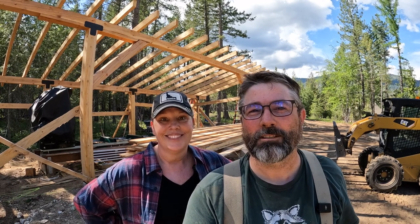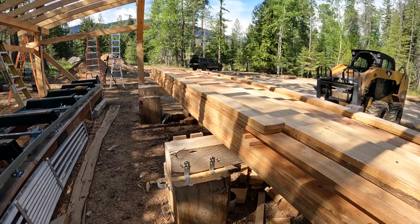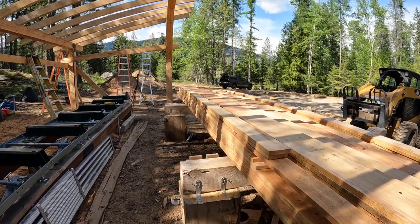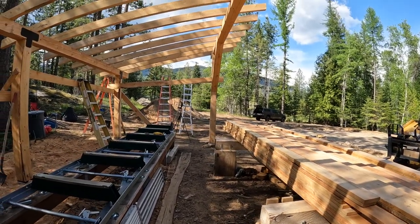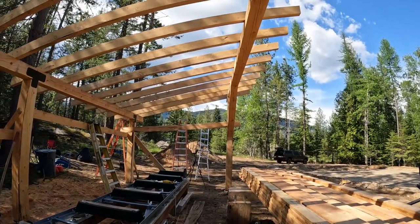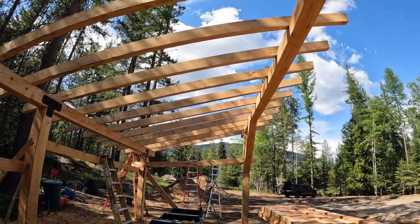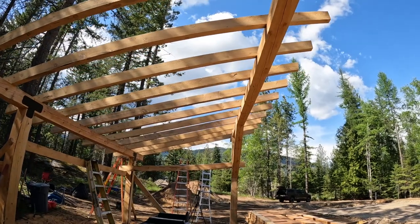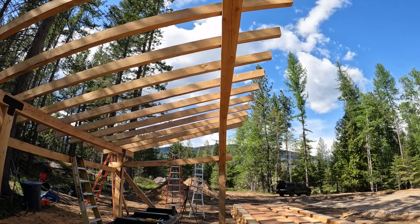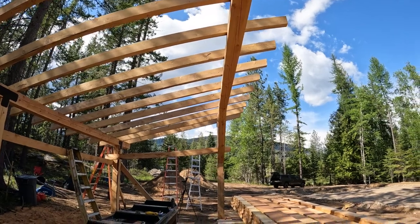We have a big question, whether we have enough sheeting, whether I've made enough sheeting. Take a look. So I'm gonna sheet the roof solid with the boards butted up next to each other. Main reason, I know that's overkill, but the main reason is that I want to be matchy with the barn. Not doing any joinery, no tongue and groove, no lap joint, just tied up against the next board, knowing that I'm going to have some shrinkage and some gaps in the future, but that's just going to be part of it.